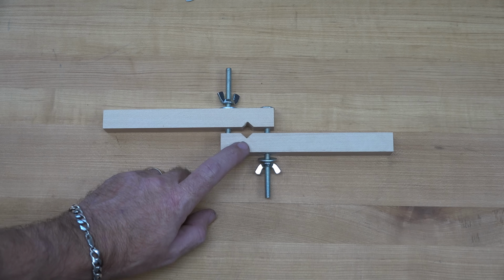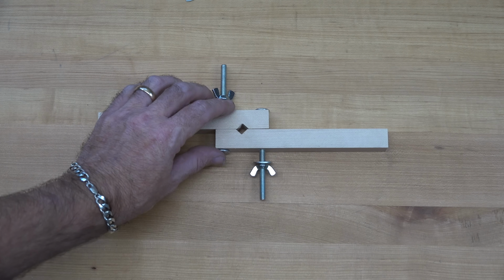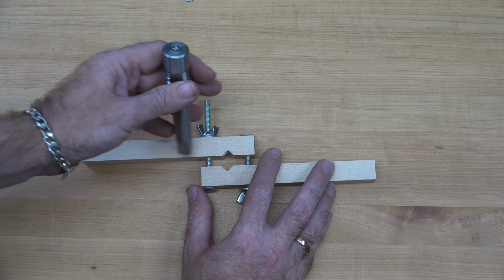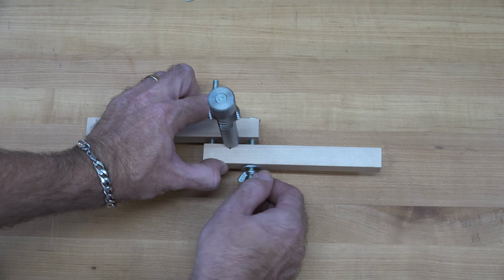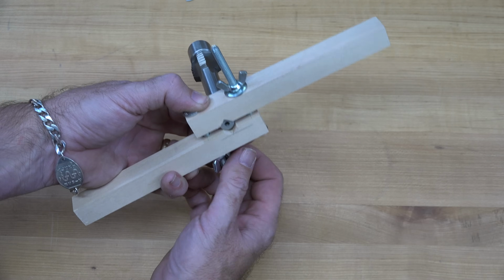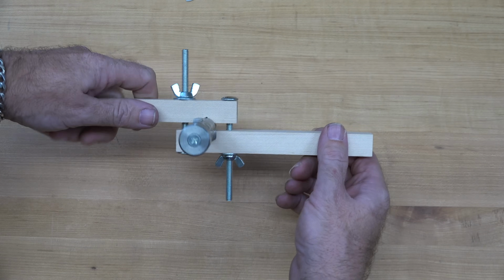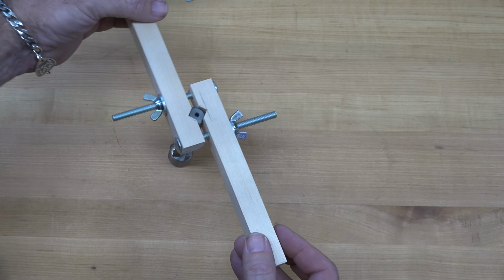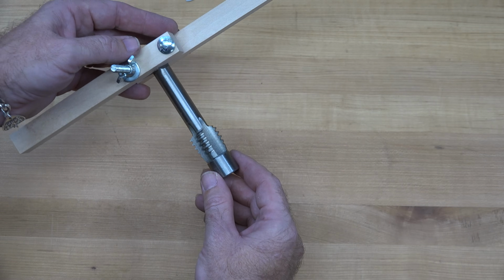And at this point, at 1 inch into the point, I've used a router bit and put this little groove in each piece. And essentially all we do is when we're tapping the hole, our tap will sit in our homemade tap handles, and you just give it a little crank down like that on both sides. And because of that notch in either piece, this is going to hold it firmly so that you can put it in your hole and turn it as such to thread the inside of the nut that you're making. This is one of the taps for threading the nuts.